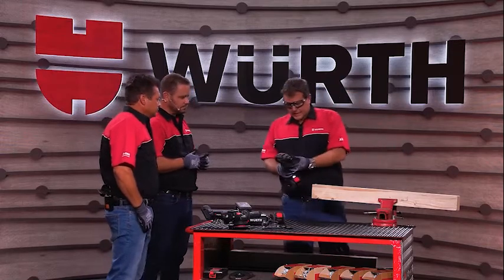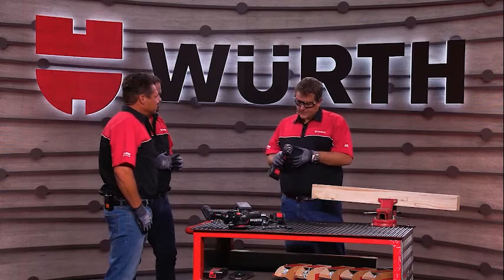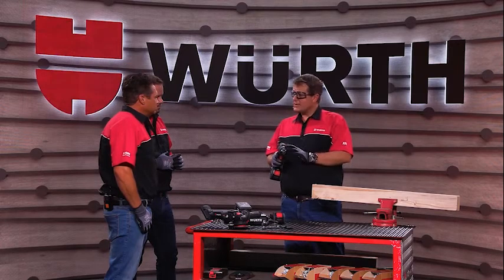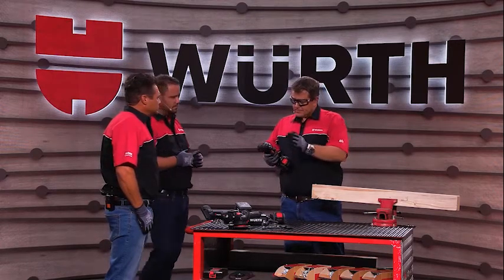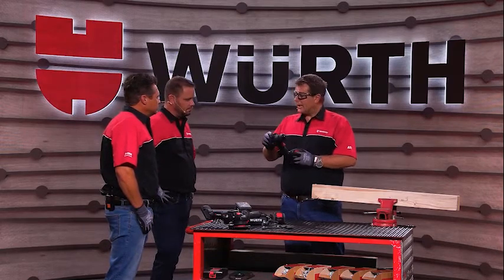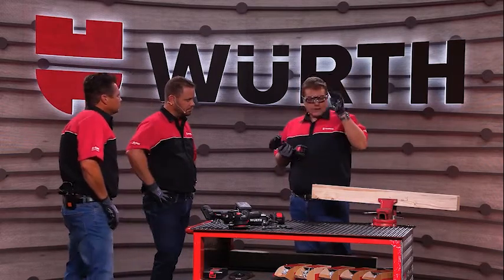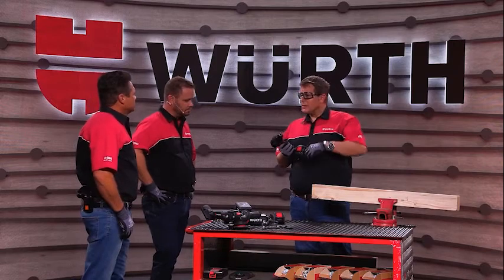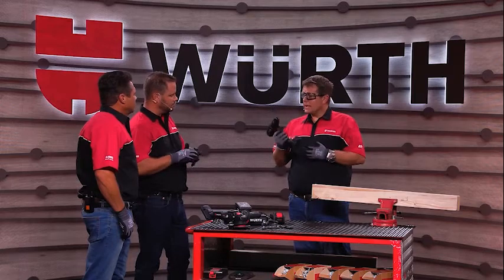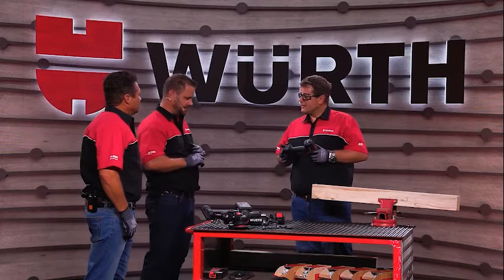Talking of the power, we've got 24 settings on the tool for your torque, which run all the way through, and there's a static setting as well for your drilling. It has an all-metal chuck, which has your carbide tips in it. And this little guy, although it's small, is perfect for medium work, drilling into wood up to 20 mil, going into metal 13 mil, but particularly brilliant for screwing in screws. So what you're saying is size doesn't matter? Size doesn't matter in this case, Derek, unfortunately.